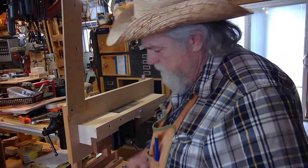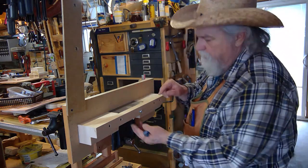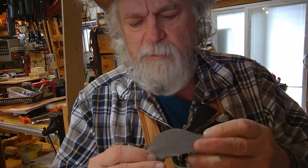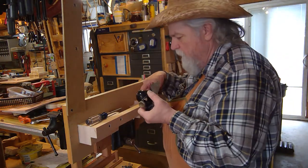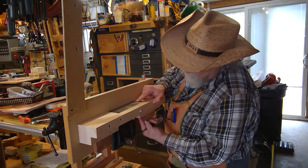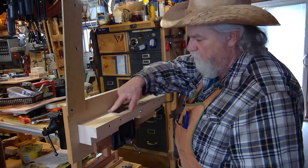I can lift the hardboard out of the way, then loosen the set screw that holds the plane against the backboard so everything stays true, flat, and level. To level the front edge, I look at my block plane — it's a Stanley block plane, possibly a low-angle — I removed the knob from the front, leaving just the threaded bolt. I drilled a hole for it to slip into to help align the plane, and I put another screw underneath that I can turn up and down to get it level.